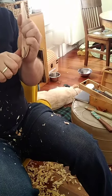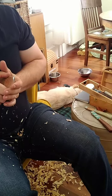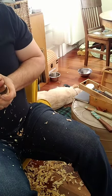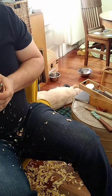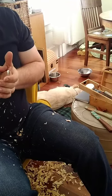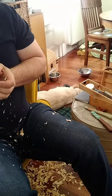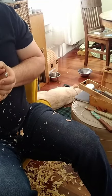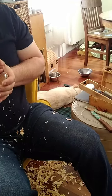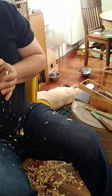And then once the rim is totally the way I want it, then I do, again, those cuts that sort of start right at the rim, but don't actually start cutting in until you get down below the level of the rim. And that's how you end up making cuts that will clean up all of those facets. If you don't want to clean it up, it's perfectly possible to make delightful bowls that show facets in the bowls. It's just not how I'm challenging myself right now.